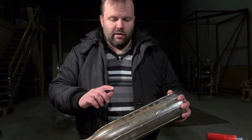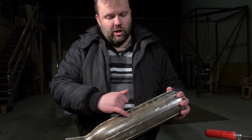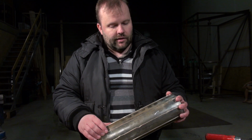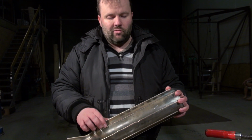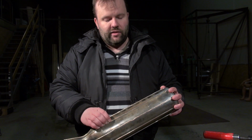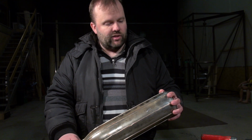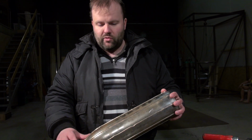Now, the flow will be inhibited and slowed down along or very close to the copper spacers. However, there is so much heat conduction through the silver solder into the copper strand that any hotspot that is likely to occur, because there actually is no flow directly underneath this copper spacer, it's very likely we won't see that, because the heat is so efficiently transferred into the copper strand, which is further cooled along two sides from the passing alcohol flow. So basically, I'm pretty satisfied with the result.